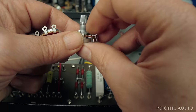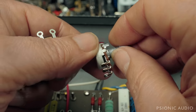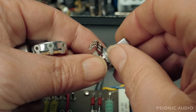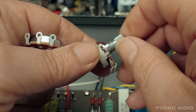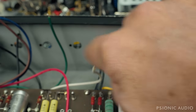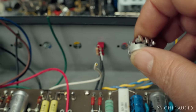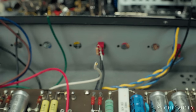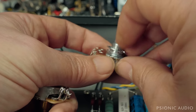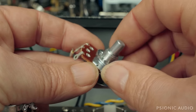The other thing to look at is the bushing material. The bushing material on the 16mm alpha pots, like most 16mm pots, is pretty soft metal and it's really easy to strip, and you cannot tighten them all the way as much as you'd like. They're held in place by this little tab, which fits into the little drilled holes in the chassis. So you can get them fairly tight, but you can't really get them rock solid. With the 24mm pots, whether it's the CTS or the alpha, use a toothed washer, and because the bushing material is much, much better, you can really torque them.